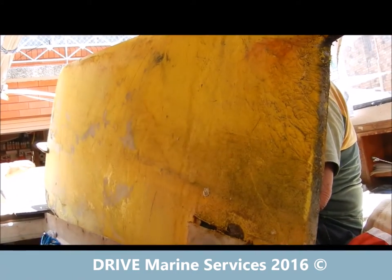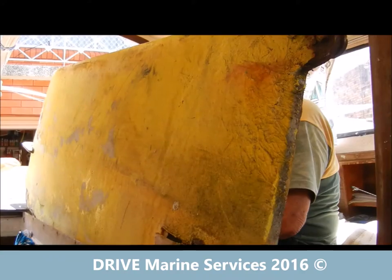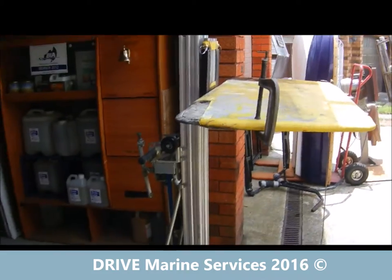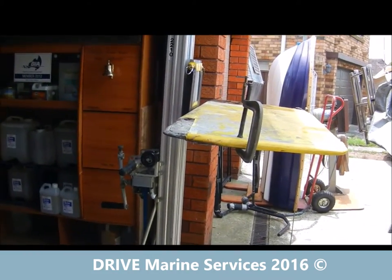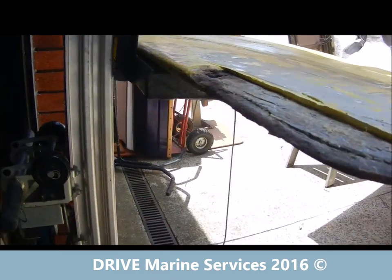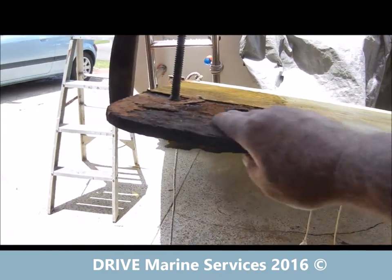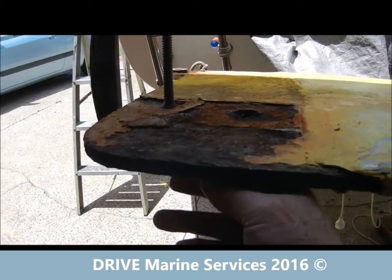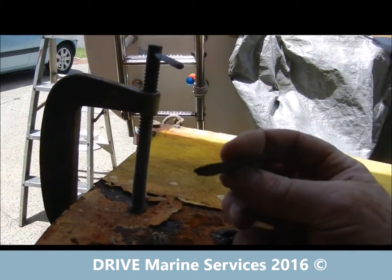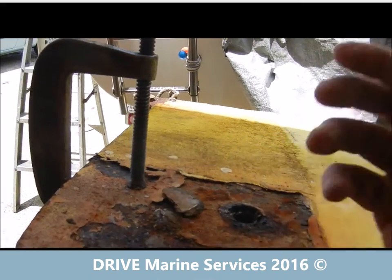We've got the bottom of it sitting on a piece of polypropylene to slide it out of the cockpit, with a bar through the pivot point. We got the beast out — it's sitting on the little lifter and boy is it heavy. There's corrosion in the front and quite a bit there, and I suspect there's corrosion up in this area too because it's a little uneven, and down from the top as well. Remember, rust grows 16 times the amount of metal it takes off, so it looks quite bad but that's 16 times thicker than the actual metal removed.